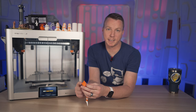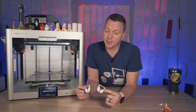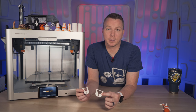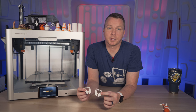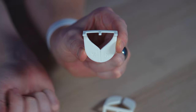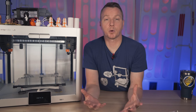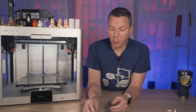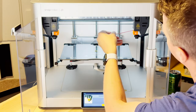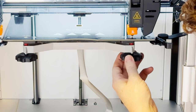But this was literally one of the first prints I did, and before I properly adjusted the belt tension or anything else. Speaking of belt tension, one of the sets of files that comes on here are the X and Y belt tensioner tools. This is a pretty simple process — you place each of these on an X belt or a Y belt, and there are a couple of simple places where you can adjust the tension, getting this little gap here to close. I love that there are tools that come essentially with the printer to allow you to make sure you've got it just right.